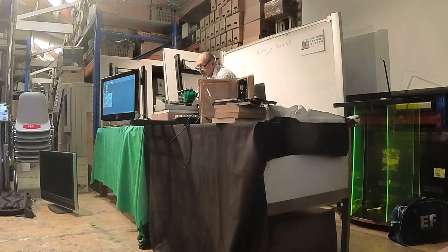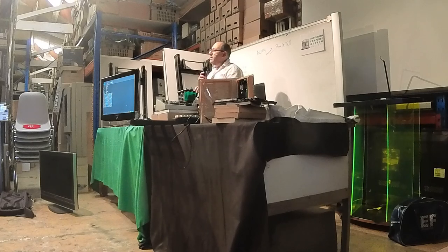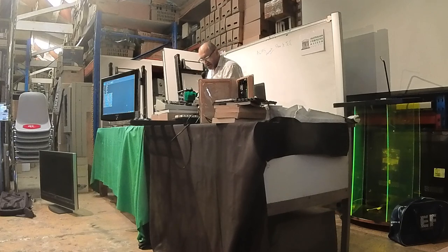Okay. So now it's waiting for some input from the terminal there. I need to send text file. And I'll load up just some binary. Okay, that's loaded. That's actually loaded at 4000, but naturally nothing changed there because it's got a smart option on this computer to protect the particular set of memory. So from location 4000 to 7FFF is a protected mode, and if you try to load something on there while the program is running, it won't update it, so you're not going to lose code. So I tried to actually load that at 4000, it didn't work, so I'll just do that again.